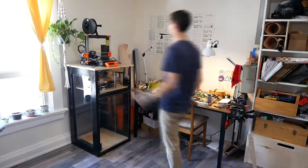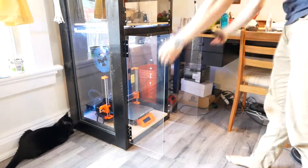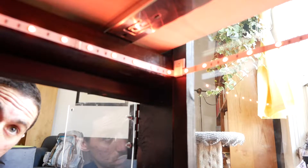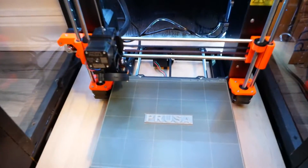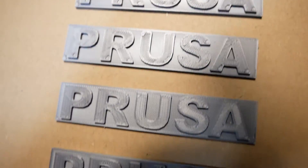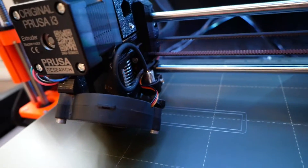All right, it's the next day. Got the printer moved into its final home and redid all the calibration since it's not going to be moving from here. Got the lights all set up, got power coming in, and did some test prints. I was having a little bit of trouble with over-extrusion on the first couple of Prusa logos, but I learned I can live tune the flow rate. And through doing that, I got a result that I'm really happy with. Still going to do some fine tuning in the slicer and get a nice preset for my setup, but super happy — this thing prints really nicely.